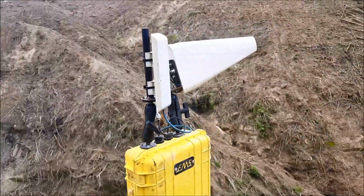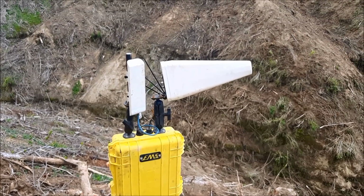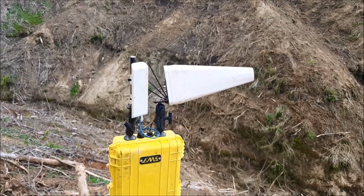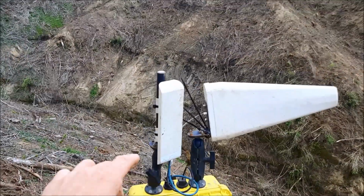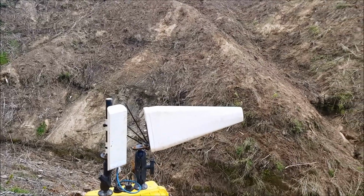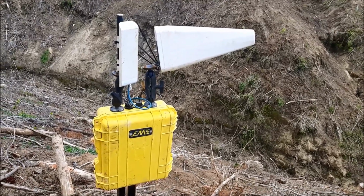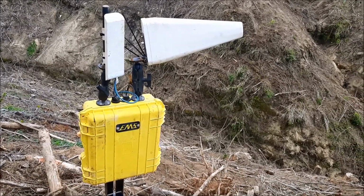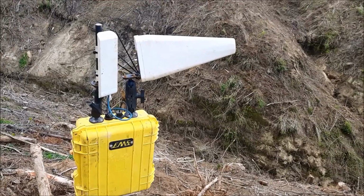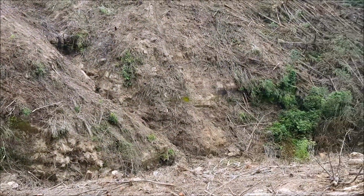And here's the repeater for the carriage right there. This one is actually for a traction line, but it works perfectly well with the hauler. All we do is change one thing on it, and that's the aerial at the top. Big square one, this one here, we just change that one over when we go to a different carriage. As long as the carriage and the internals, the two repeaters on the inside, are matching on the yellow box in the carriage, they will work fine. And then you have to make sure you've got matching square aerials to the aerial in the cab, and you're fine.